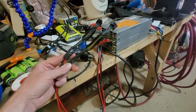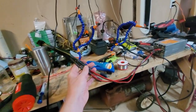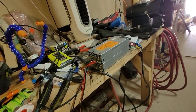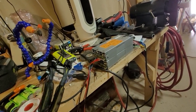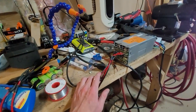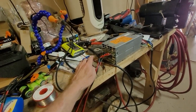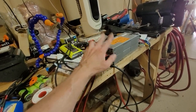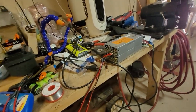Now I've got my two power pins soldered up ready to go, got a nice long pigtail on it so I can put this wherever I want. I'm going to stick it on top of the computer for now and run it off a power strip so that when I turn the computer on, this comes on at the same time. I'm also thinking about pulling a 12 volt line from the PSU, running it to a 12 volt relay, so this closes and turns on and off at the same time. I'll do that later once I prove this actually works and doesn't blow up my RX 580.